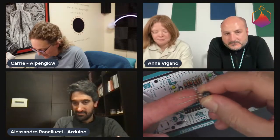Cool. Okay. So before I do another thing in the wrong order, what would you suggest next? The capacitors, C6 and C7. Okay, got it, and I got those. The capacitor is polarized. There we go. Yes, these are the electrolytic capacitors. Cool. Right, so we have C6 and C7, and these are also sensitive to polarity. So we have the negative marked on them. Negative, yes. And the long pin is positive, the same as with the LED. Yep, exactly. Same with the LEDs. So putting that in there, and this one in here.